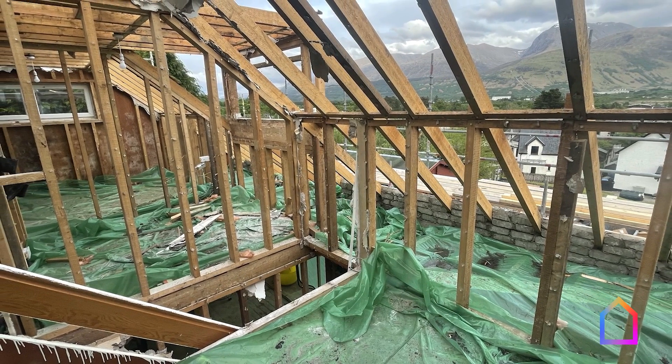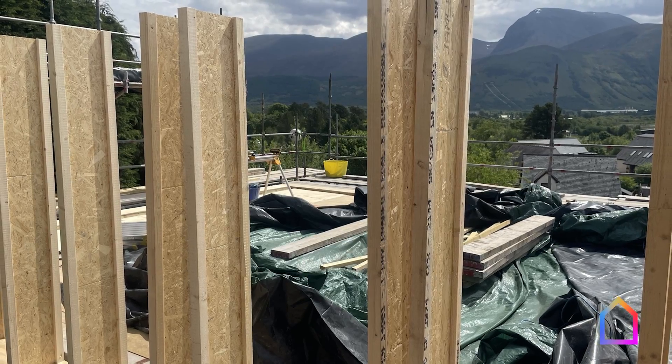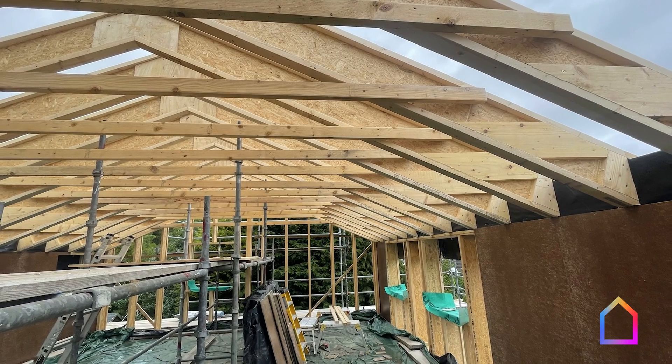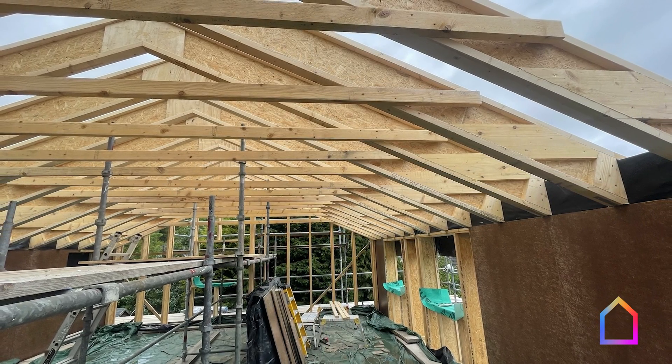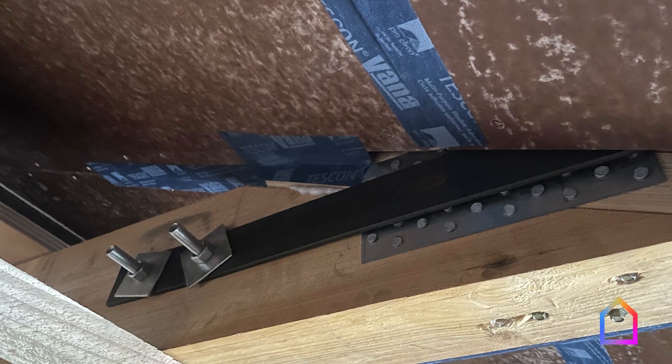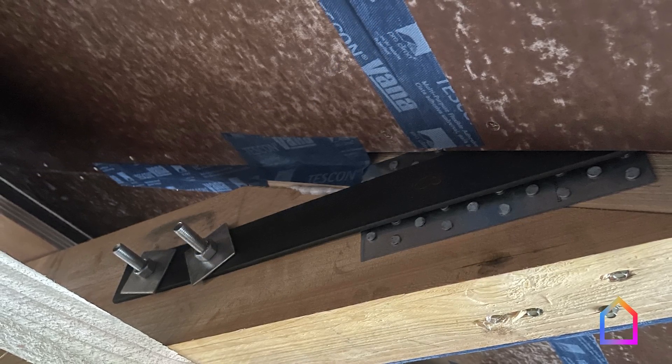The main job for us was to take the roof off. The actual roof design itself was quite complicated — engineer and architect drawings — and there was a little bit of back and forth between us and the engineers, because some of the details were really complicated and sometimes it's easier to draw on paper than to do in real life. There were compromises made on both sides, but we all got what we needed to get the roof off. The second challenge was the airtightness layer — the airtightness board on the inside of the i-joist — putting the boards on, making sure the joints are taped around the windows. That was a real big part of making the project what it needed to be, because if you get those details wrong, the house would never have hit the target.